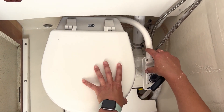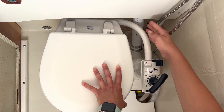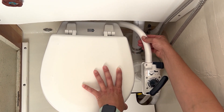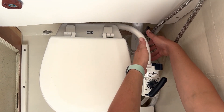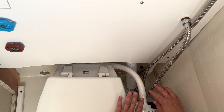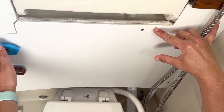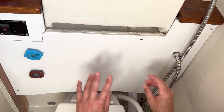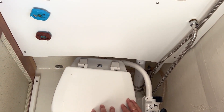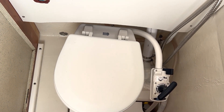It's important when you're installing your system that you have access for not only your hands but your tools. Thinking about maintenance, repair, clogs, cleaning out piping, or replacing parts — you want to be able to access all of that. You can have a system with panels that cover your plumbing, as we've done here, but make sure you can access behind those panels anytime. We have simple screws you can unscrew to access behind the panel. We decided to leave this open for simplicity, making it easier to access the common maintenance areas of your toilet.